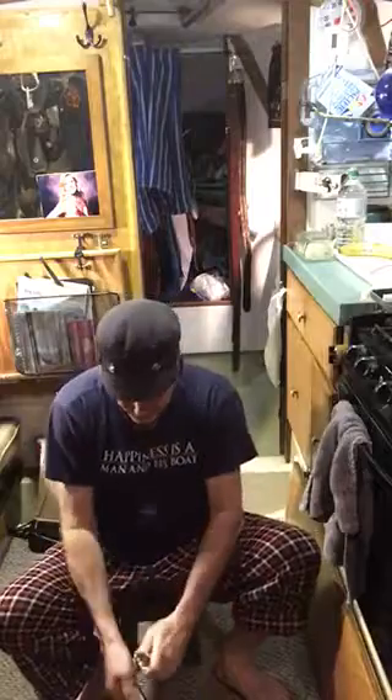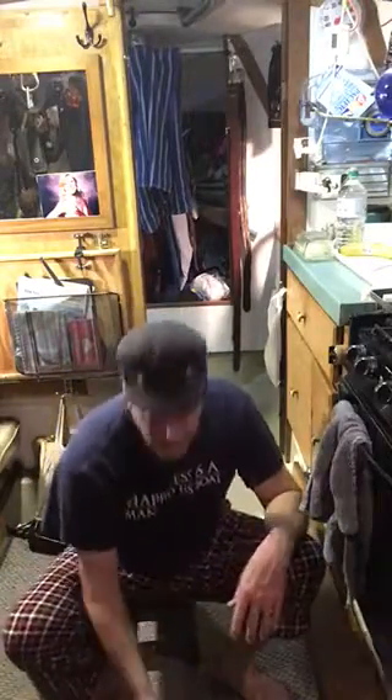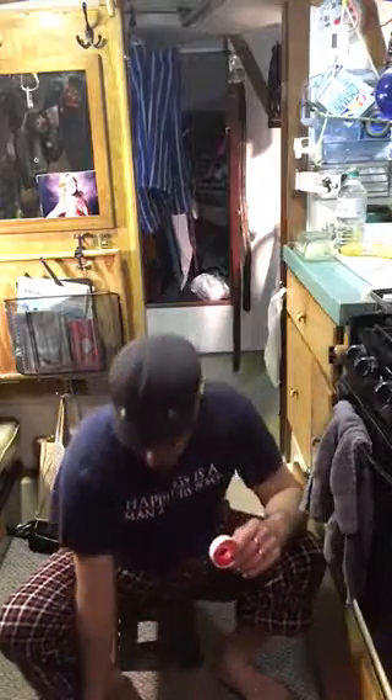The whole process took me about 15 minutes. The reason I like using Teflon tape on my through-holes is I don't over-tighten them — I just make them snug and a little bit more. You can always take them off; they don't get frozen in place. If you want to crank them down hard, you can, but when you go to take them off years later, they'll be very hard.